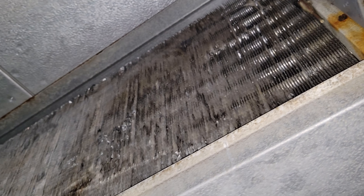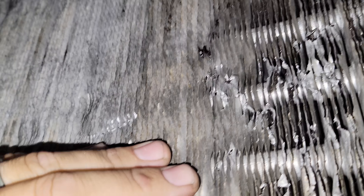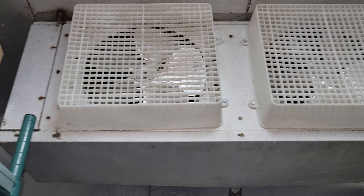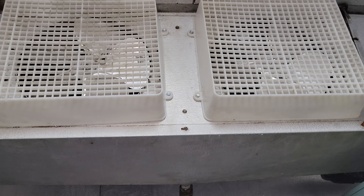We got a bunch of ice, but it's clear. The coil's kind of rotted out — a little bit of crud buildup inside of it still, but it's just disintegrating. This thermostat's not clicking on and off. I put a sensing bulb right here, right next to it, and it's not clicking where it should be. So we're going to go ahead and change the control too. You can just turn it and listen to the point at which it clicks and compare it to a thermometer sitting next to it. It'll tell you if it's even relatively close, and it's not. So we're going to go ahead and change that — get a new defrost clock and temp control on this guy.